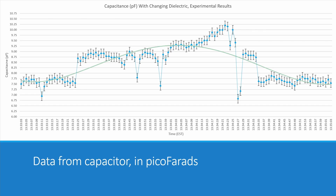We can expect the sensor to output maybe three, four, or five different states — dry conditions, mildly wet conditions, and very wet conditions. We could probably tune the sensor itself to show more change in capacitance, since this is a very unoptimized version. Putting the container of water with a very thin plastic base over the capacitor only yielded about 11 picofarads at the very peaks, more consistently around 10.2 picofarads. Even with a polycarbonate layer — so one or two millimeters less water — we're still getting almost all the way to that full capacitance value, which means our capacitor is working well and is sensitive to changes in water exactly where we want it to be.